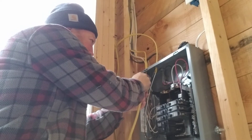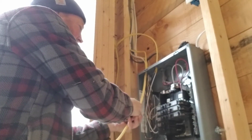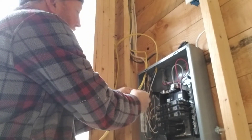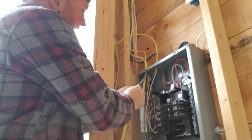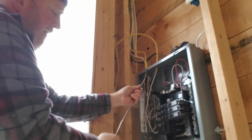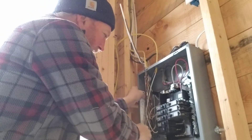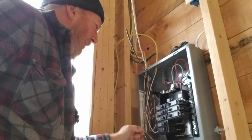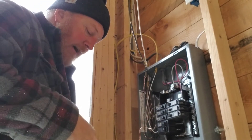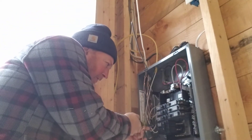Put your knife blade right in the middle on top of the jacket and hold your hands together so you won't slip and hit your hands — and you're also controlling the knife so it doesn't drop into something live inside the panel. You only have to score a little bit of the romex jacket and you can peel the conductors right out — there are your three conductors. Trim the jacket back and the whole thing slides right off. I like to get my ground wire done first because it's bare and I worry it could touch something.